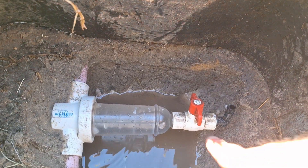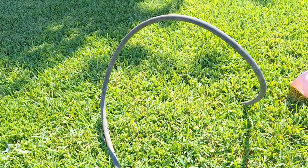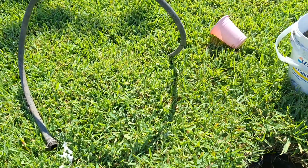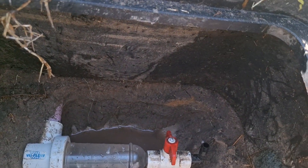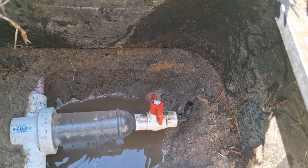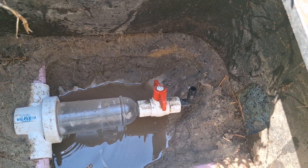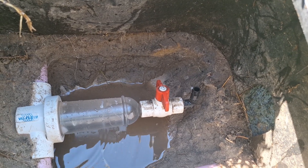This little nipple right here — I can pull that hose out, open up that valve, shoot water across the street and check my city pressure, make sure that's not an issue before I go forth and further troubleshoot my system.